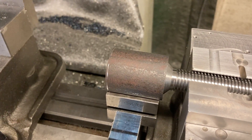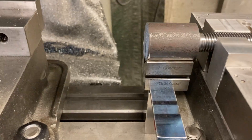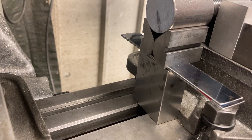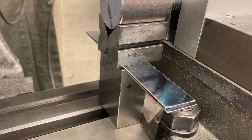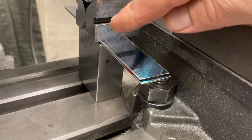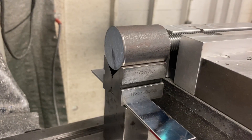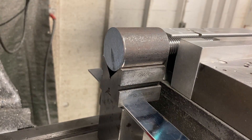When we're milling it, it does chatter even though the three-quarter inch shank we're holding on to is pretty robust. So I stacked up some blocks — I got a one-two-three block underneath, and then the V-block right there. I couldn't get the perfect stack height so I grabbed a couple pieces of shim and found what fit in nicely. I put the V-block in, pull it up, then slide the shims in and finagle them in there. The accumulative stack-up height is pretty close and there's pressure on it, so when the tool comes over and cuts the top it doesn't chatter at all. On the last pass I get a smoother finish with no chatter.